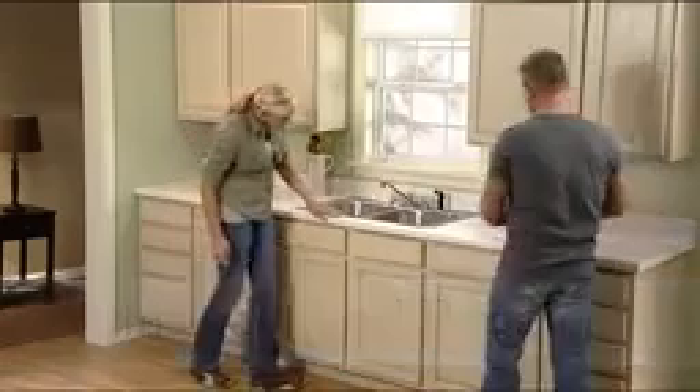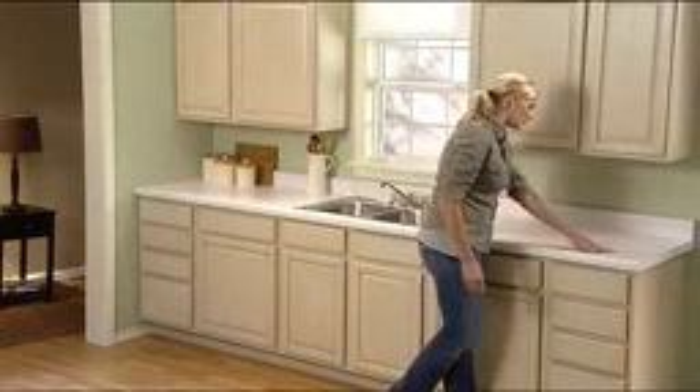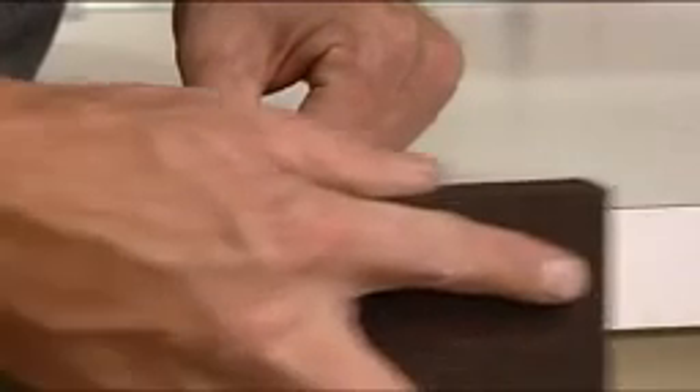Let's get started by removing everything from your countertops and inspecting them carefully. They must be in good condition. Small burns, scratches, and blemishes will be coated easily, so there's no need to treat these separately. However, areas with excessive caulk, such as near the wall or around the sink, should be scraped off with a putty knife or paint scraper. Cracks where countertops meet at the corners, along with dents and chips, will need to be filled before you start. To repair, lightly sand the spot first with a medium grit sandpaper and use a two-part epoxy putty to fill in the area. Let dry and sand flush to the surrounding area.